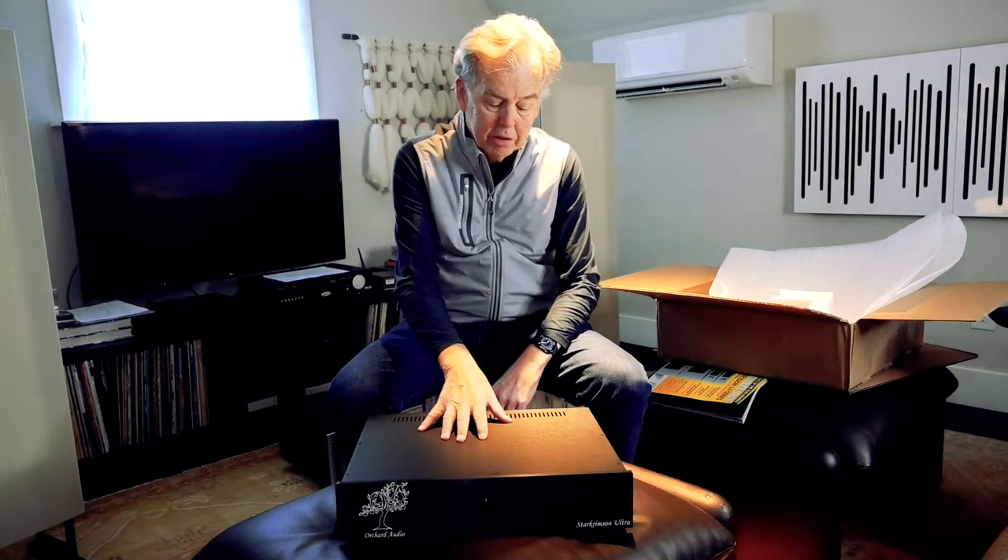Class D amplifiers also tend to be lighter because of a really important feature, which is that they're very efficient. Class D amplifiers are typically about 80% efficient. That means to get a certain amount of power out, you need about 1.25 times that power level going in. In this case, we're going to try to produce a thousand watts total, so we should have a wall outlet capable of 1,250 watts — 1,000 watts times 1.25 is 1,250. That might or might not sound impressive, but there are a couple of key points.